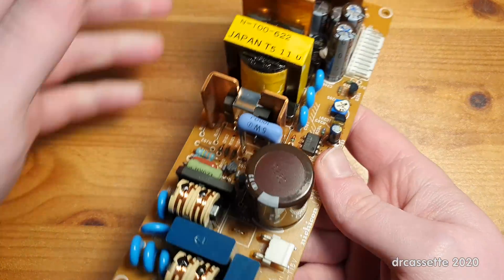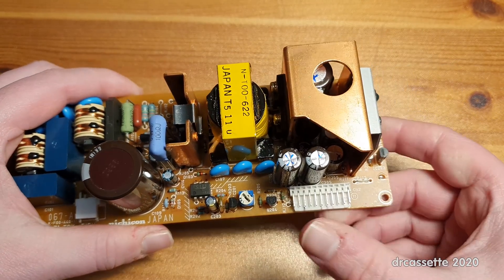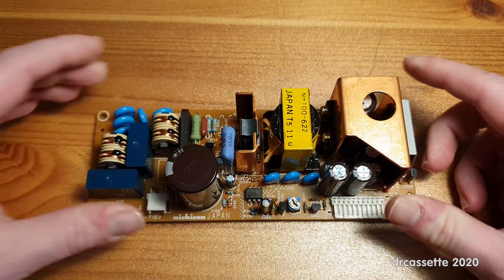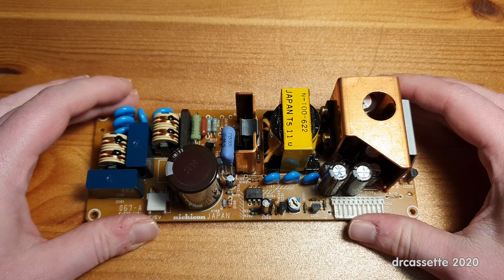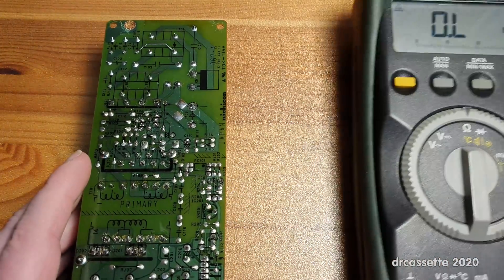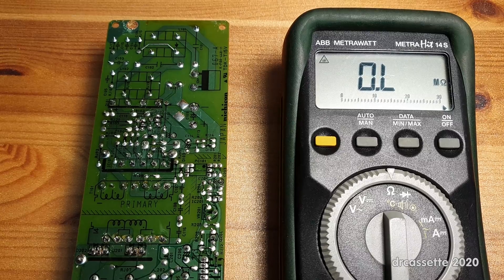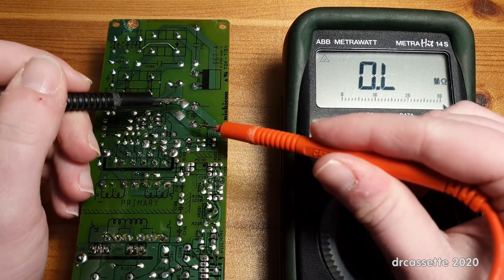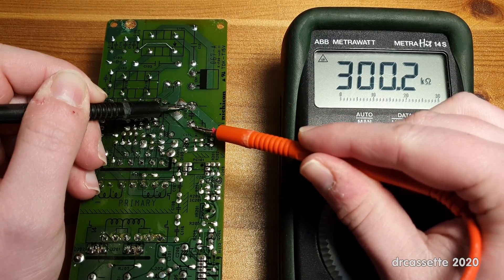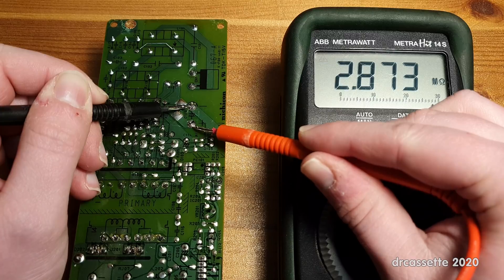The new MA2830 has been installed on the board, and in addition to that I've also replaced this small capacitor. I'm not going to replace the secondary side filter capacitors until I've confirmed that the power supply is working, because if it isn't working that would be a waste. Let's repeat the resistance measurement across the filter capacitor and see if that has changed now that we have the new MA2830 in place — and it hasn't changed negatively. Resistance keeps rising and we're in the megaohms range, as it's supposed to be.